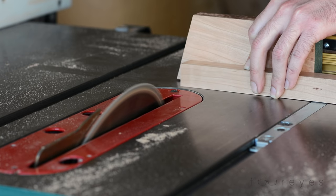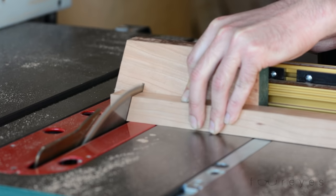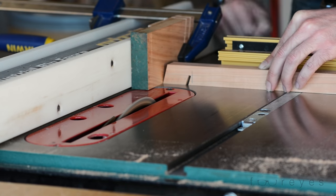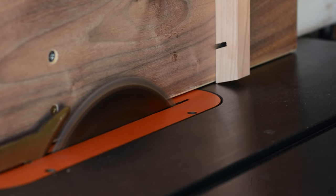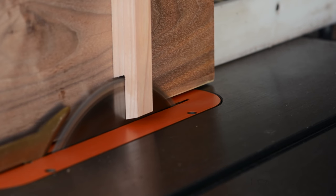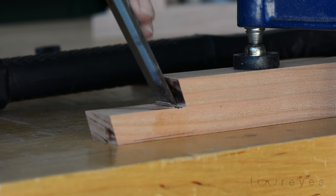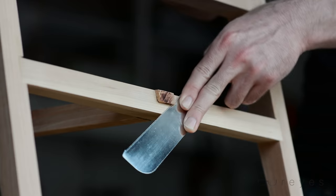With the base mostly finished, I turned my attention to the stretcher — the piece that would run between the two legs. This was the second tricky part of the build. I needed to cut joinery on the ends to mate with the dados I just cut in the cross pieces, but the inside edge needed to match that 18 degree angle. I couldn't use the dado blade here because if you tilt the blade at 18 degrees, you're going to end up with it way higher on one side than the other. So instead I made a cut with a regular blade at 18 degrees, then turned the piece vertical and cut out the remainder. This left a minimized version of the problem the dado blade would have left, but it was easy to clean up with a chisel. I went ahead and left the piece long on the edges so I could clean it up to match the outside 15 degree angle after gluing the whole base together.